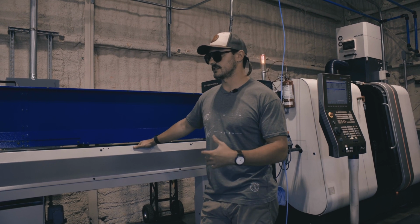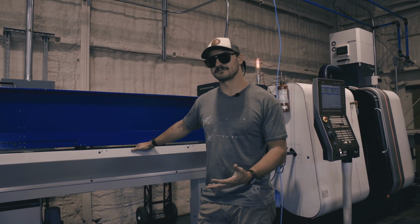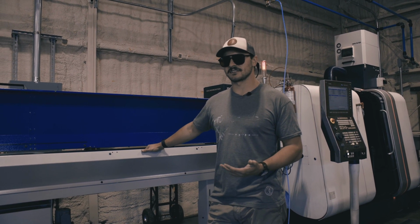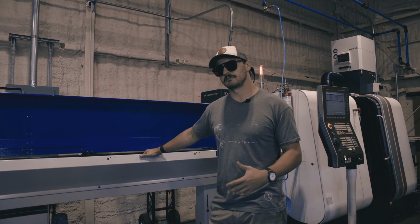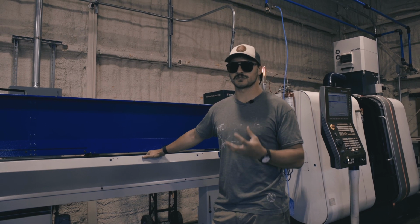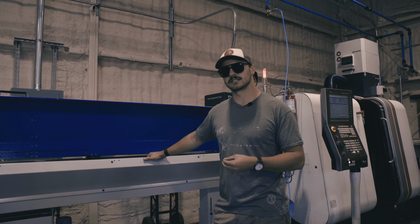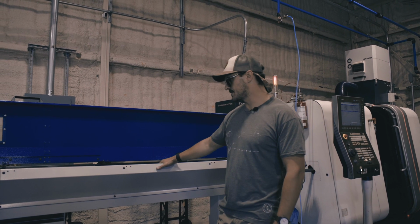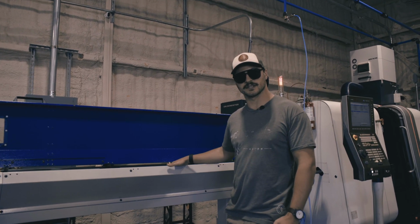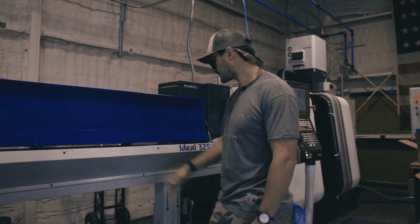And we will spin material, a 12-foot bar of material, at up to 10,000 RPMs, which is important because generally speaking, the smaller the part, the faster you need to spin it in order to get the proper cutting conditions. So still a bar feeder, still a lathe, just a lot fancier, a lot faster.